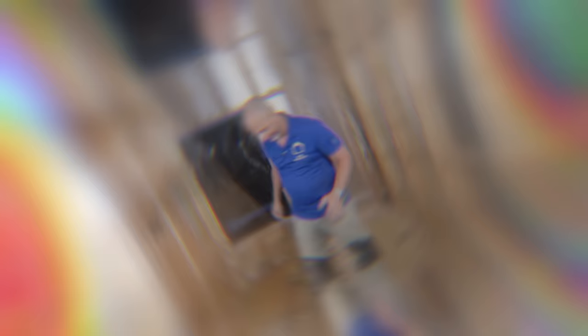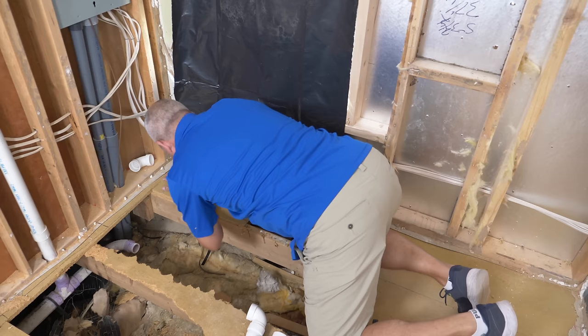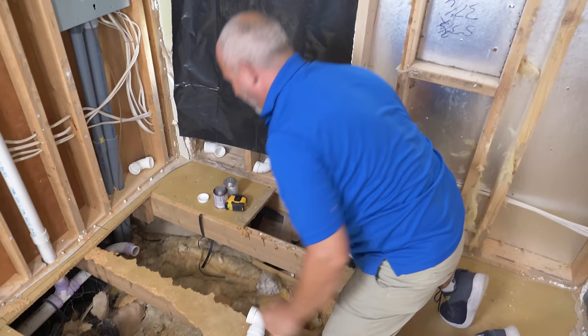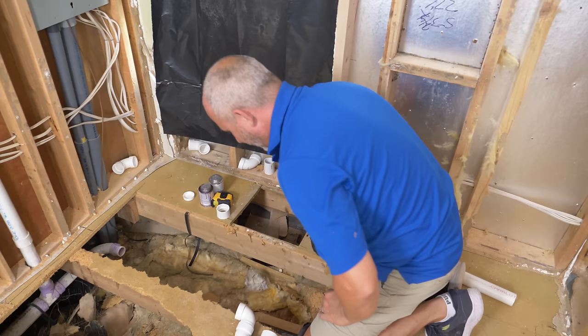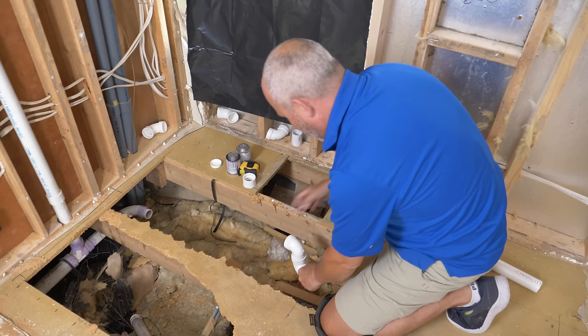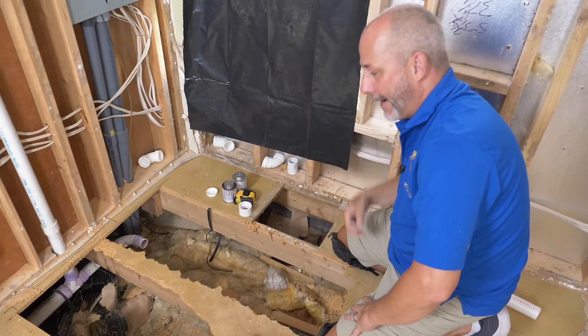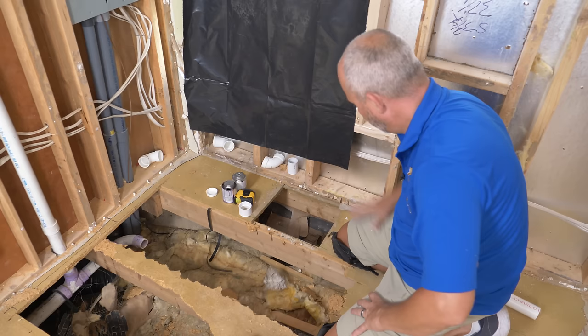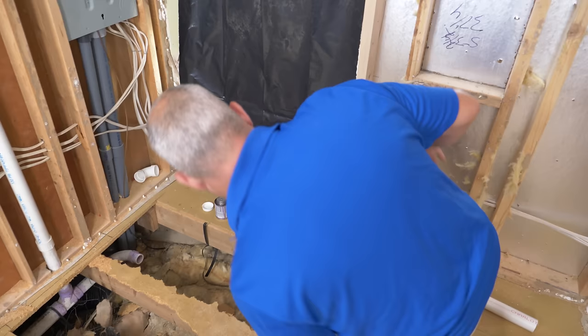We're back — not the same day, that's for sure. I'm taking off this test cap and getting my glue back out. I needed a coupling, which I bought, and I need pipe to bring it out to here, then stick on my proper p-trap — we want this to end up at the line 23 inches off the wall. I also bought a tub — a 59-inch instead of going to the full extent, just to leave a gap on each end and around the back for cleaning and installation. Lots of room to work with — whenever you can give yourself a little mercy, take it.